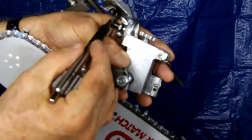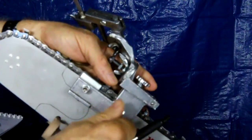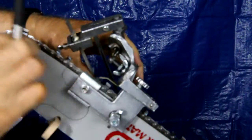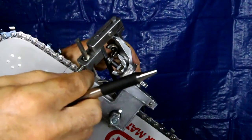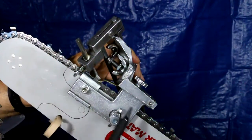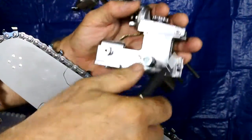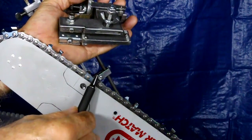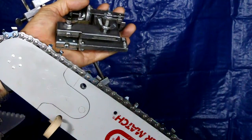I also have another control in here which is a stop, so when this device is on the unit, this stop screw will prevent the file frame from moving forward beyond a certain point, enabling me to control the lengths of the cutters. We want to control the length of the cutters pretty accurately because they're sloped down — we control the length, we control the height, and we want all of these cutters to have the same height so they do the same work.